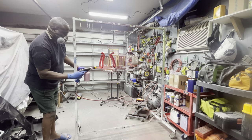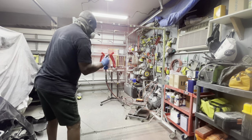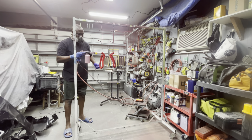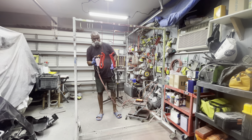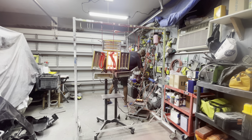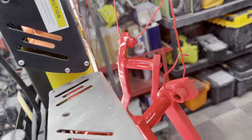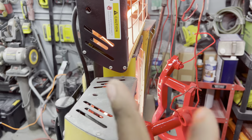Because the part is already at a high temperature as I'm laying the powder, it's actually already melting onto the part. It's always good to do a 360° around your part to make sure you have full coverage with no missing areas, and then add a little more powder to any areas that need leveling. As the powder goes through its curing phase it flows out really nicely — as long as the temperature stays consistent it won't be lumpy. As you can see here, it's starting to produce a shiny overcoat over the metal.